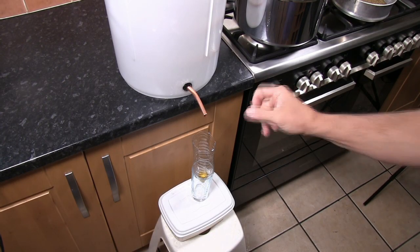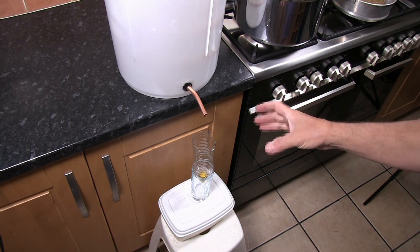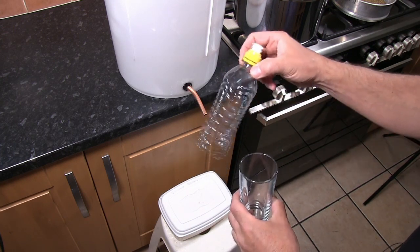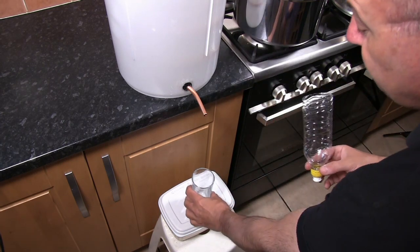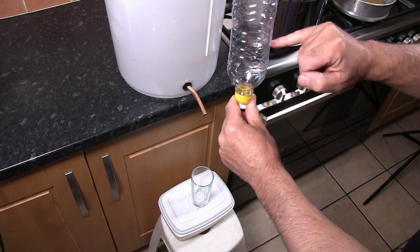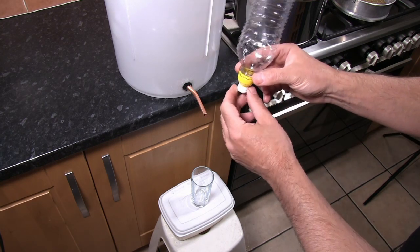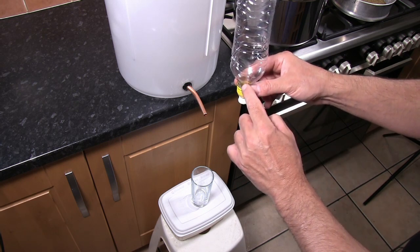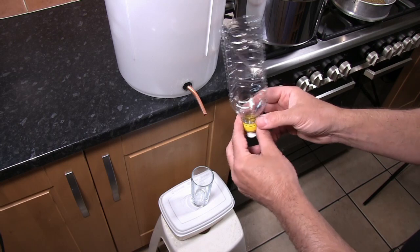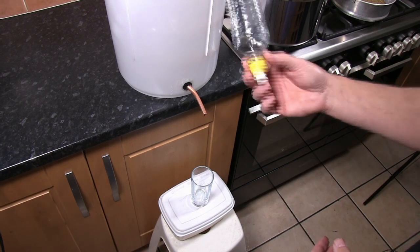With regards to collecting the water and hopefully some essential oil from the spout, I wanted the cheapest and easiest way to prove the concept. I've got a glass and an old sports drinks bottle with the end cut off. It sits in the top of the glass, fills up with water with a film of essential oil on top. When distillation is finished, pull down on the mouthpiece to drain water out until you're left with the essential oils, then push it back up to seal it and decant the oils.